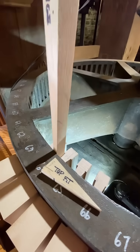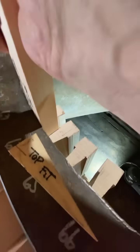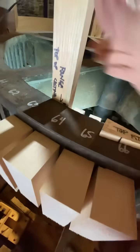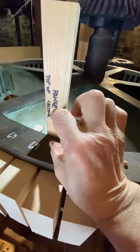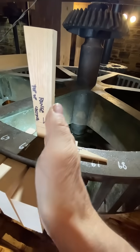So that just slides in and is tight. Now I checked how it is — there's variation on all of them and I'll show you how much. You can see that I've marked the top of the casting on that location, but if I stick it here, that's tight. You can see the range — there's a little bit of play, so these have to be hand-plane fitted.